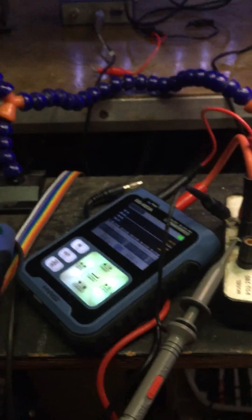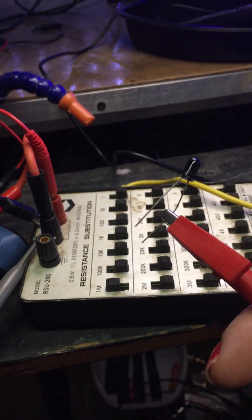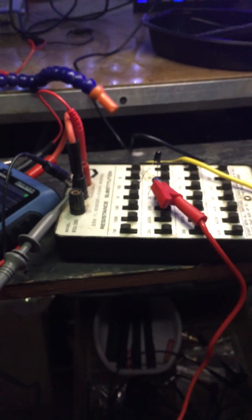My big interest in this was to be able to profile sensors — this has a voltage source which is quite accurate too, adjustable down to the millivolt, which I can't do with any of my power supplies. This one you can adjust by the microamp, which isn't bad. Anytime you have any kind of sensor — I foresee using this for thermistors and CDS photo cells — this lets you profile the range even without a data sheet. It's a way of testing the sensor using a constant current source and measuring the voltage off of it.